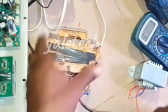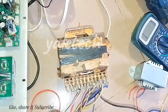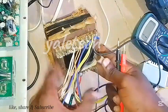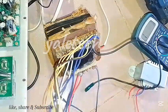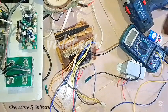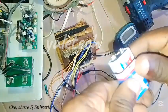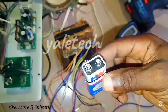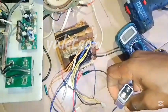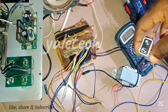Another way to check is to just plug it to the mains and read the output, but that can be dangerous — some bad transformers may explode. So always check with a multimeter first before you plug it in. If you found this video helpful, please like and subscribe. Watch out for my next video where I will show you how to test a transformer when you don't have a multimeter — just a battery and a LED, and you'll be able to know if your transformer is still okay or not. Thank you so much.